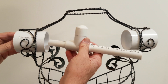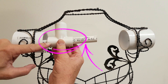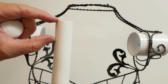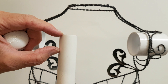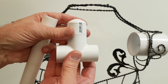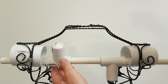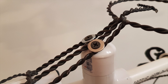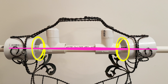Next I create the axle housing, one on each side of the neck, for the one half inch PVC pipe axle. I use a three quarter inch T coupler, a three quarter inch cap, and a short section of three quarter inch PVC pipe for each of the two housings. Using just enough pipe to connect the cap to the upright portion of the T coupler, I glued these pieces together. I then marked on the top of each cap their connection location on the neck and shoulder area of the wire dress frame. Using the same screw and washer method as before, I will attach them to the wire frame at a location that will position the arm's rotating axle rod pretty much in the center of the two shoulder joints.